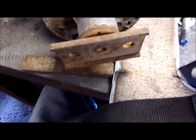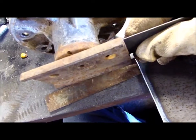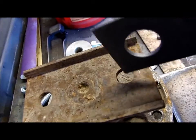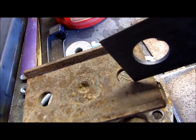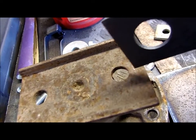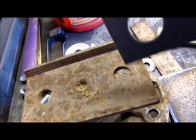Smashing capacity. So what I'm going to do - this section here spins with this. There are several ways of doing it but to cut to the chase, I'm just going to elongate this bolt hole just a little bit with the torch and make that bolt hole just a little bit longer. I don't want to go too far otherwise we won't have enough meat here to stop it pulling out, but we should be able to get to there and get a nut and bolt right the way through.